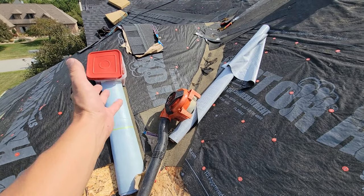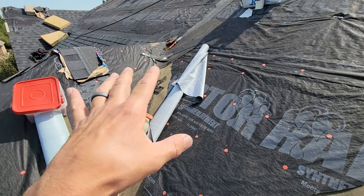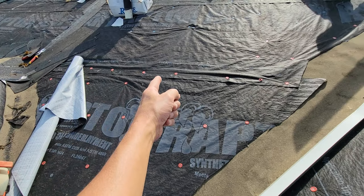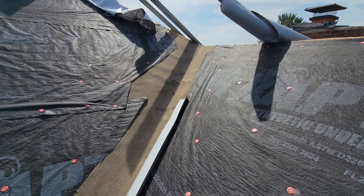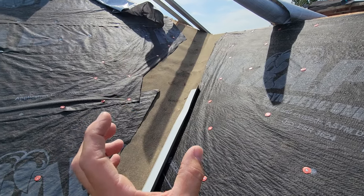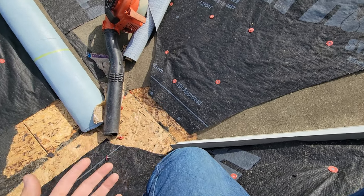Now for those of you wondering — yes, it's already dried in, we're trying to keep the guys moving. What I was talking about is when we bring this up to about that point right there, we're going to ice and water the new deck, the new facet we just made. We're going to put a pass on it and tuck under this pass of synthetic paper right here, going over the valley and covering the section — just dry this all in again. Your valley roll is your last defense: if you did not tuck under or go over onto your new facet and you had a leak, it's going to run right in under your roof structure.